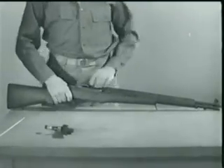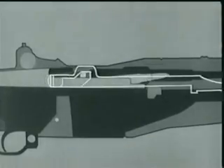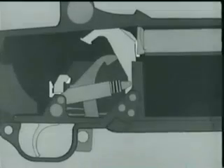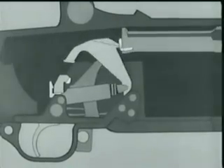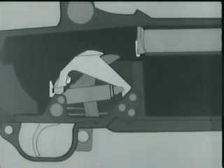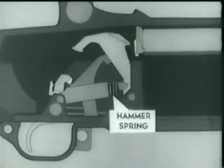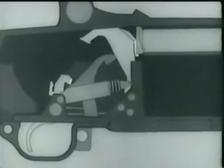Let's stop here a minute, remove the barrel and receiver from the stock, and take a look at what's happening at the rear of the bolt as it locks. Watch the firing pin tang line up with a cutout slot in the receiver bridge when the bolt rotates. Here's the complete action of locking. Now that the bolt is locked, we're ready to fire. The hammer was cocked and placed in this position when we opened the breech to load the clips. When the trigger is pressed, the trigger lugs rotate, and the hammer hooks are released. The hammer spring forces the hammer forward.